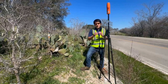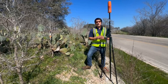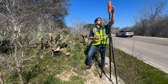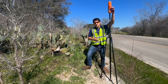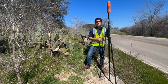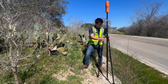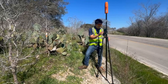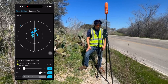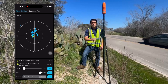The deviation plot lets you set your plot center with the coordinates of that known point, and then it'll tell you how far off you are in the horizontal. For the vertical, we check that on the home screen of our Flex — we're converting for orthometric height, which means we're applying that geoid offset to our ellipsoidal height and reporting it directly on screen. Opening that up — no adjusting needed — we're already about sub-centimeter. I'm getting about 0.5 to 0.7 centimeters on the horizontal.